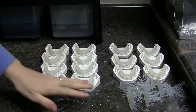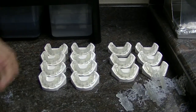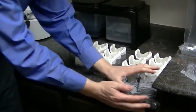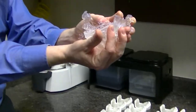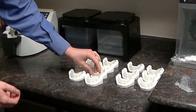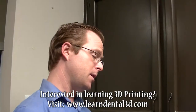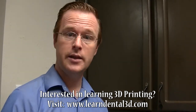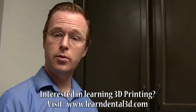I just cleaned off the supports on eight models that you see right here. I just take some of this material, pull it off to the side, and then this goes right here in the trash. Now I've got my models here ready for our hands-on demonstration. It's pretty easy to remove support structures from laser SLA type prints, like here on the Form 2 3D printer.